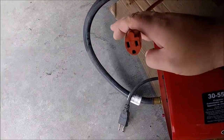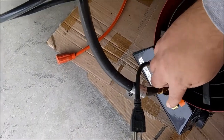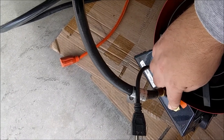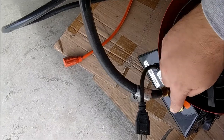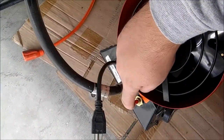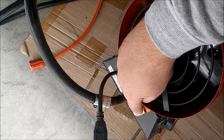The process here is: you plug it in. There's an igniter — that button right there. You hold that down for like the first 10 to 20 seconds of operation. So you plug it in, you push the igniter down, you open the bottle. Once the igniter is pushed down, it'll light. Then you just hold that button for 20 or 30 seconds to make sure it stays running. And then that's it.